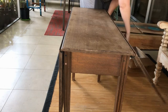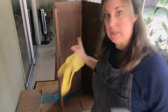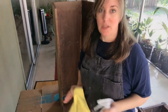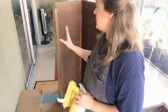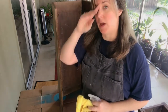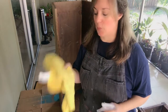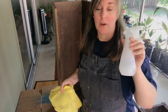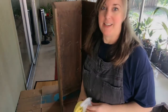See the legs? Generally speaking, if I had an old piece of furniture like this, if I were going to do a cleaning, my first cleaning would just be with a damp cloth with water because you never know what kind of finishes you're going to be able to keep. This one is so hammered, I'm going to go ahead and go directly to my water three parts with a one part vinegar wash, just because it needs it.